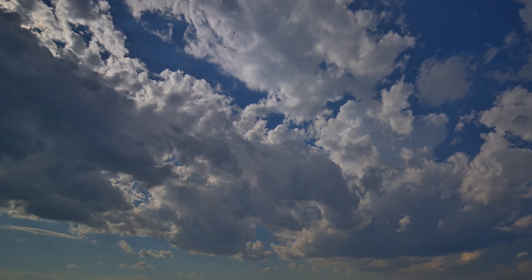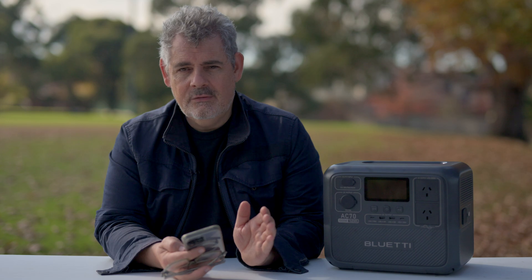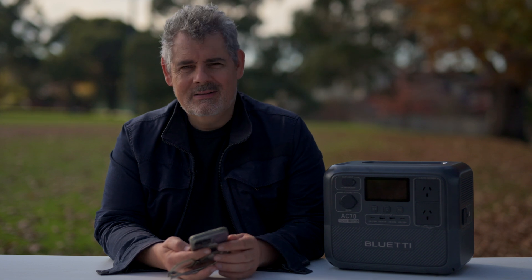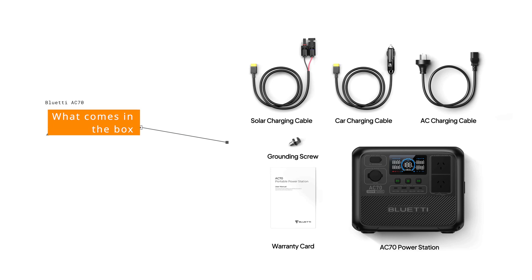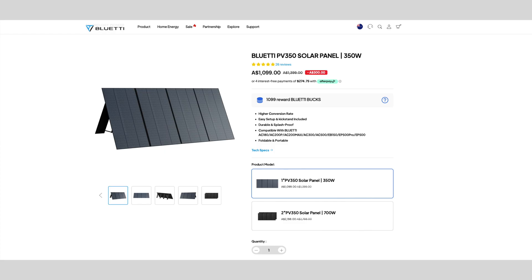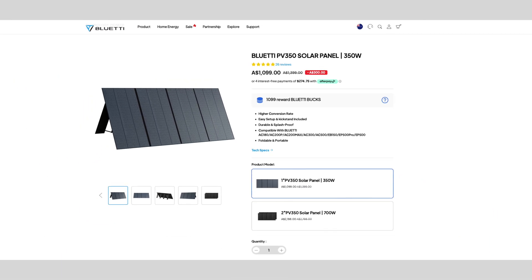It can charge at a maximum of 500 watts per hour from solar. So that means if you have a 500 watt portable solar panel, you can get this fully charged by the sun in something like an hour and a half. A lot of these batteries do slow down a little bit as they get towards 80, 90, and 100% charge, but in theory you could charge it quite quickly at 500 watts. So if you have a charging mat of that size, you just need to have it out in the sun for a couple of hours and you're done - ready to go with your camping or trip or whatever you're doing.